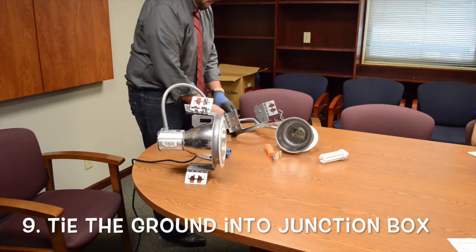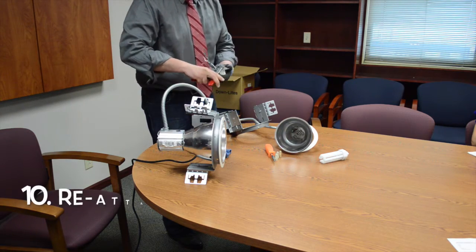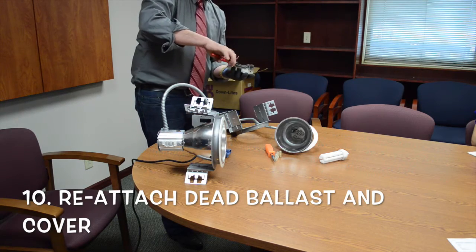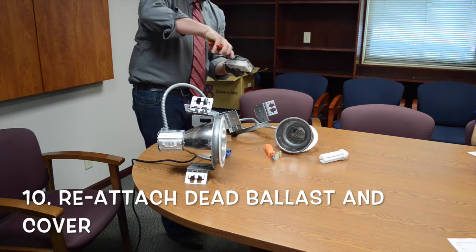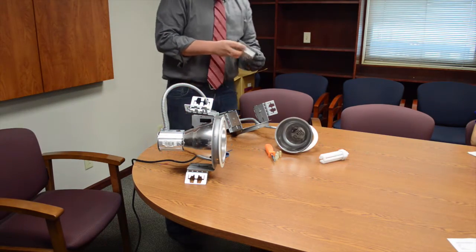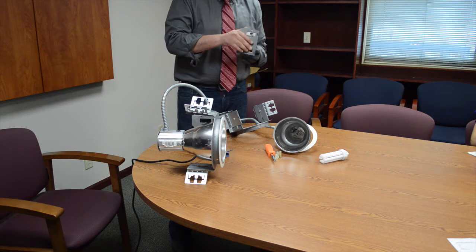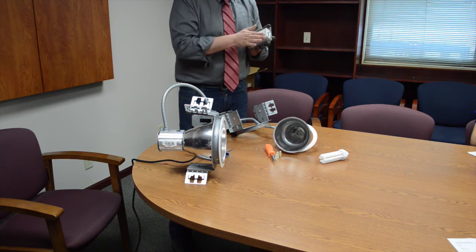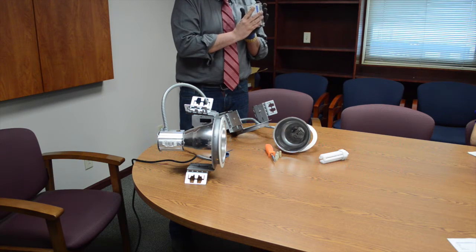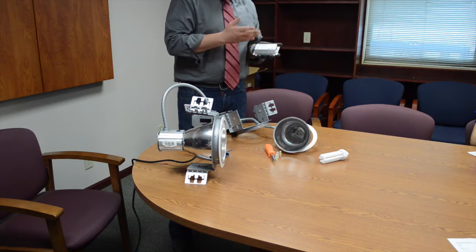From there, the only other thing I would recommend, just to keep it nice and clean, is trimming out all this old wire — that doesn't matter. Because this ballast is nothing to you; it's just there. One thing to note: this cover for your junction box has all these holes in it, so you do want to keep your driver on it to keep that protected. Even though this driver is dead and doesn't mean anything to the system, keep it in. That way you don't get much dust, no bugs can get in there, and all that kind of stuff.